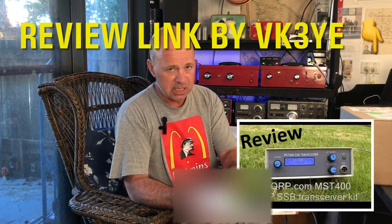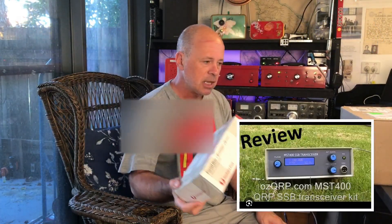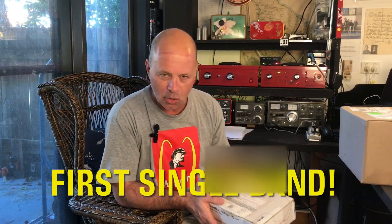This has been sitting on my desk forever - it's the AUS QRP MST transceiver. It's a single sideband transceiver that does CW and SSB. I've just got it and a DDS VFO to go with that. So that may be the second one I build. It'll be the first 20 meter rig that I've built, and as AUS QRP is no longer making gear, it'll be a lovely thing to get on the air.